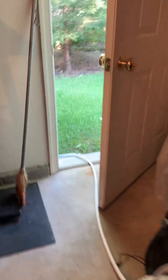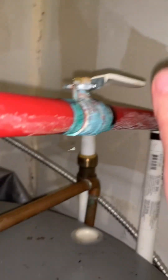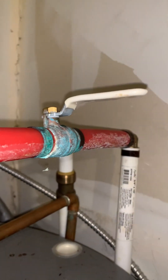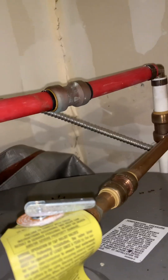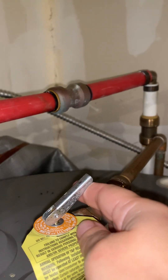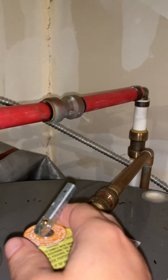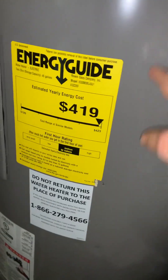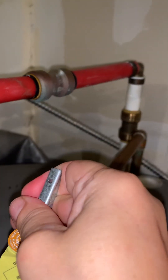The hose is outside so you can't see the water flow. That 10 seconds or more gives enough time to remove all the sediments. Then close it again to keep the water from flowing out. You can see this section here — what you do is keep the tank flowing out so you can totally empty this 40-gallon water tank. Just flip it up like that, and you'll see the effect from doing that. Here it is — it's flowing out.